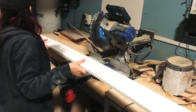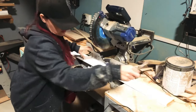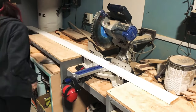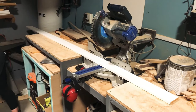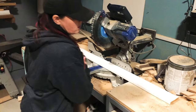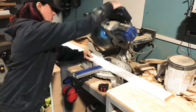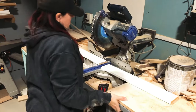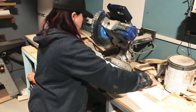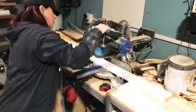Next I grabbed some molding to cut down to size for the inside side walls of the closet where it wraps around, in order to have some bracing or cleats on the side of the shelving as well. The depth of the closet on the inside is about 24 inches, so I cut these to 23 inches — just to be sure I had enough room, since I know not all my walls are level or straight.